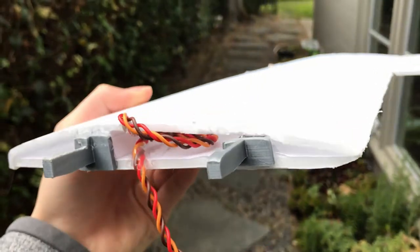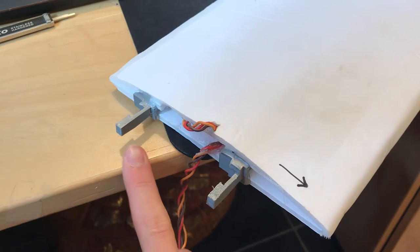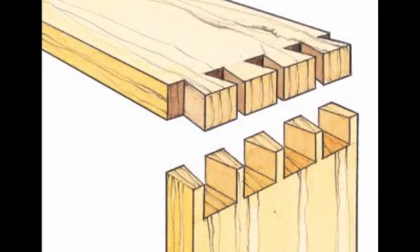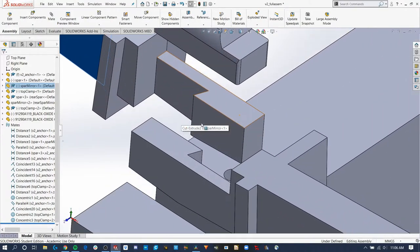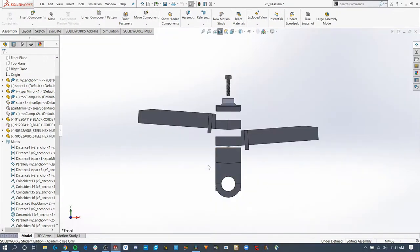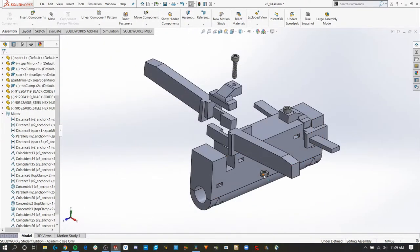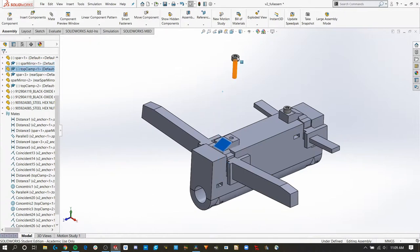I knew that I needed the main spars of the wings to attach to the motor mount, and I also needed a rear spar to prevent any lateral twisting of the wing. I was thinking a lot about wood joinery, and in particular dovetail joints. My final design sort of looks like a dovetail joint in that the sharp catches interlock with each other. After interlocking, the printed parts are seated and centered by a double ramp in the anchor block and secured by an upper clamp bolted to the anchor with an M3 bolt and a buried nut. The double ramp also creates the wing dihedral that gives the aircraft stability in the air due to the dihedral effect.